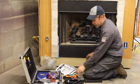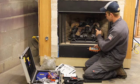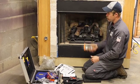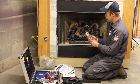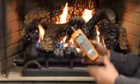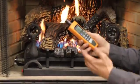Next we're going to cover parts per million detection with a carbon monoxide meter. We're going to turn this gas log set on and do a reading up here. Usually you want to wait about five to ten minutes, but we're going to do it right away. Type B vent units will often have a couple of minutes to establish draft, so they always spill monoxide at the glass door until it establishes draft.